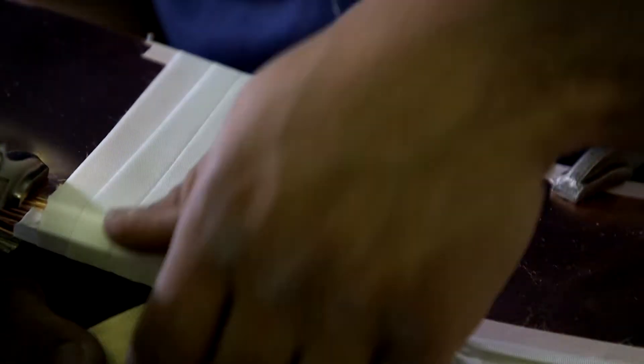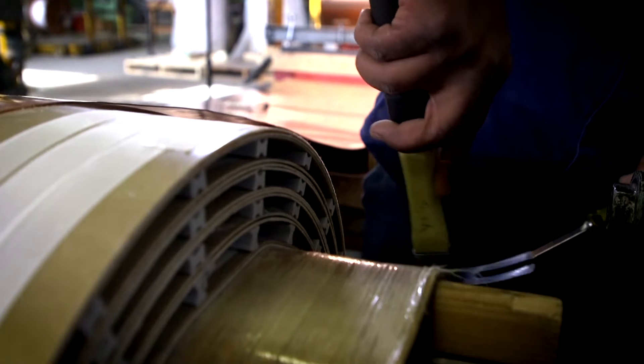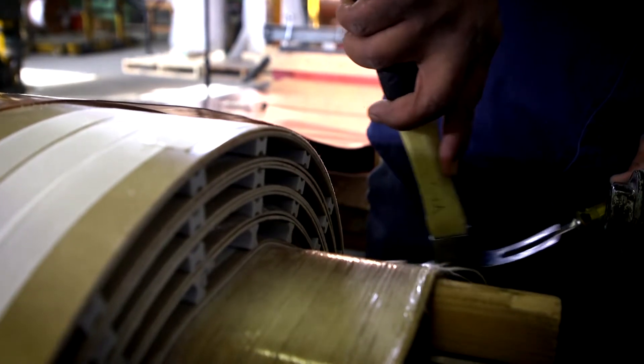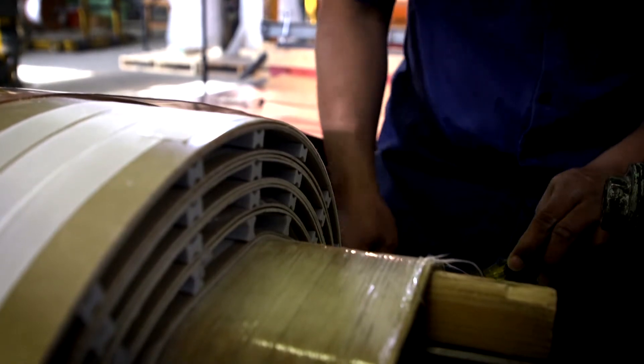Another benefit to manufacturing by hand is to ensure that all the cooling duct spacers are aligned and spaced as calculated per the bending forces. This prevents warping of the sheet conductor and increases the radial strength, which makes the coil more robust.